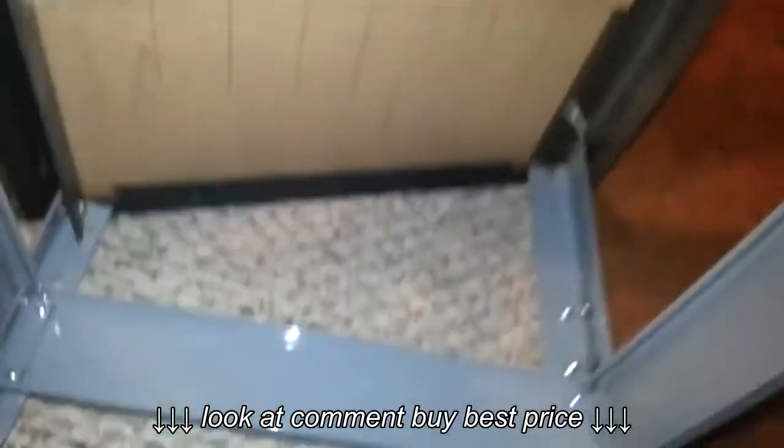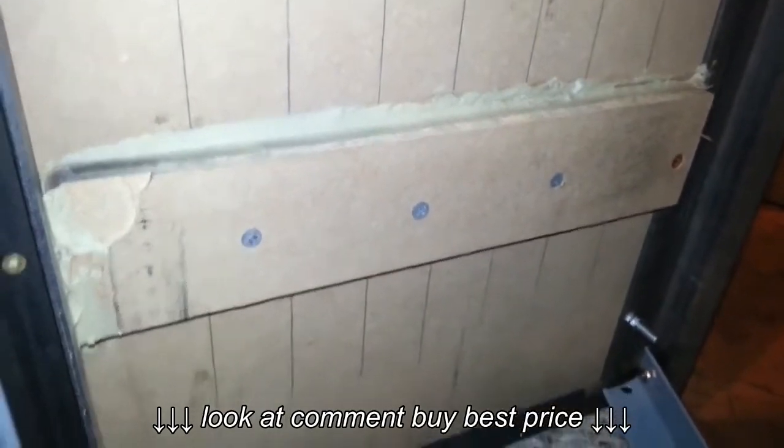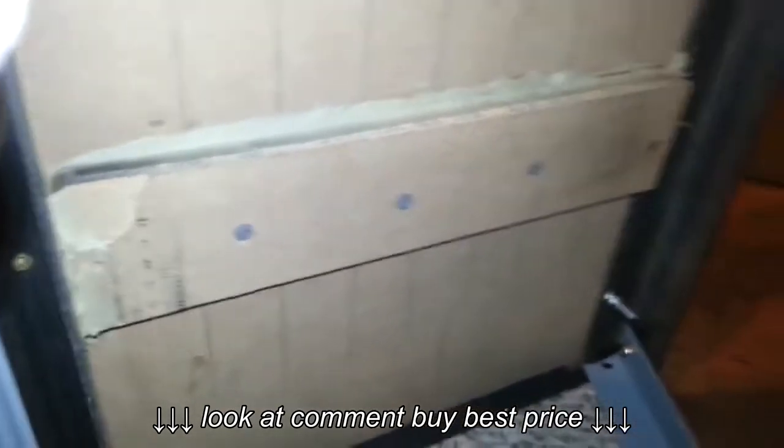Here's the strip of wood I was talking about — it's the leftover scrap piece after I cut it down to the correct measurement for the top of the stand. That's glued on plus screwed on. The two-by-four on top — I actually glued that down first and put a couple screws through the three-quarter inch press board, then put the strip over top and made sure the screws were long enough to go all the way up into the two-by-four, so the adder weights don't start hammering them out.